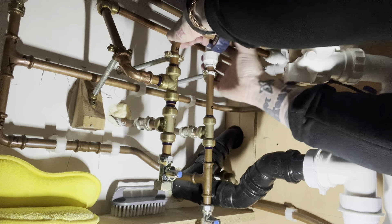Speed Fit tap flexes for this one. There's a massive plastic nut to tighten to the bottom of the sink - absolutely hate these. I had to take one of the flexes out just to get the nut on because both Speed Fit connections wouldn't fit through. Just leaking from here on this check valve - can't repair it so just swap it out. Just take note for the newbies: they've got directional arrows on them.